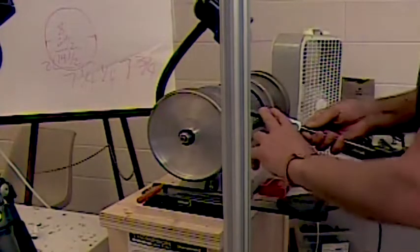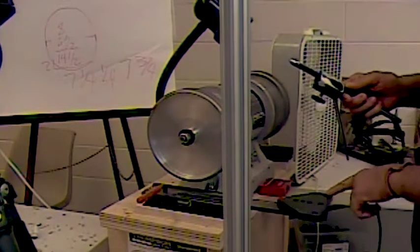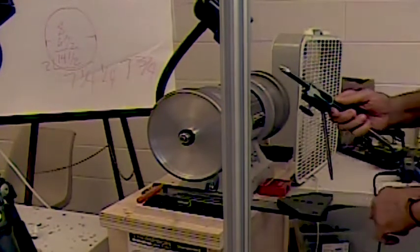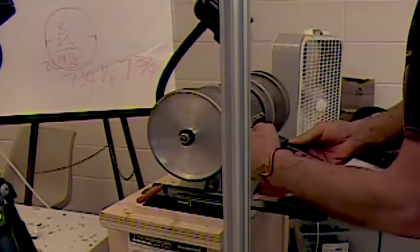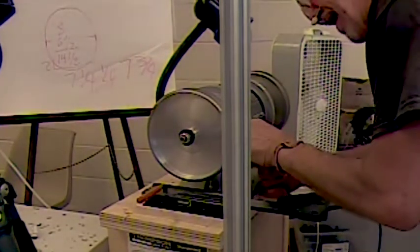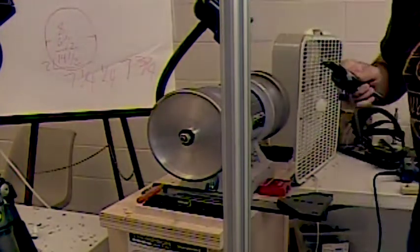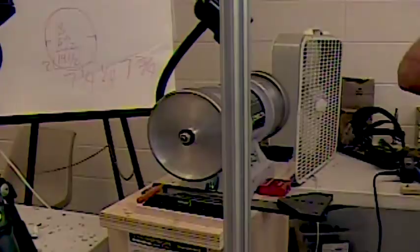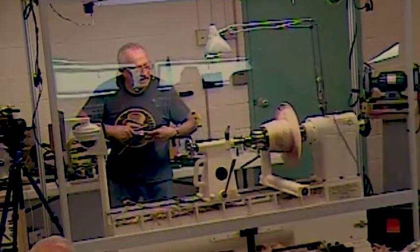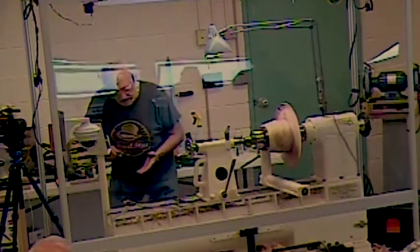So, for the right side of the tool, you use the right side pivot hole. You start a little left of center, so you roll over the nose, and go way down there like that. And that did the whole edge. That's what you have to take away to make it absolutely sharp. One swing, maybe two, just barely touching the wheel.